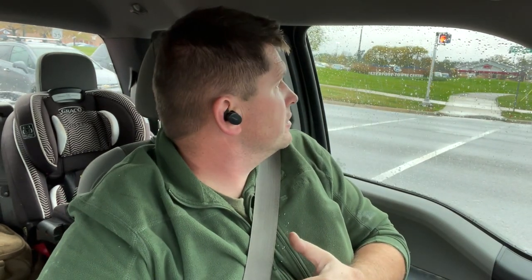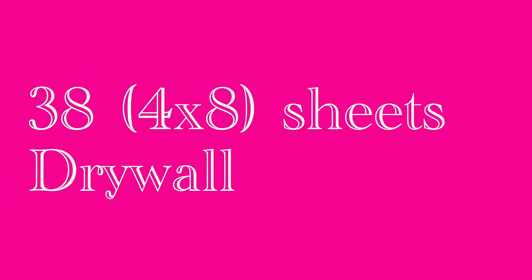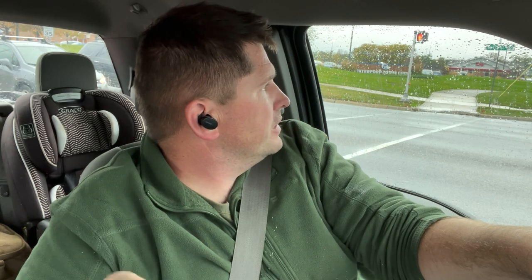I'm not doing the kitchen cabinets or counters — that's not included in the price — and not doing the floors either. I am doing all the drywall, so we've got about 40 sheets going in. We've got six 110-volt outlets, one pop-up electrical outlet in the island itself which will be cut in by the countertop contractor, so we just handle the wiring. HVAC is going to be paid separately — we do have to relocate a bunch of plumbing and HVAC, which is probably going to run between seven and ten grand, because the house was never engineered to be this open.